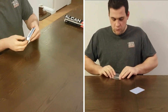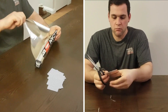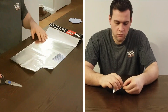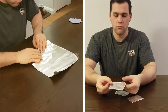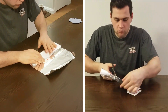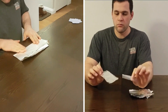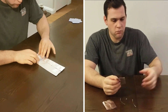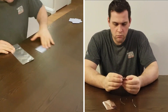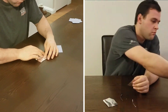While the cathodes are drying, I'm going to prepare my anodes. I'm going to take 10 of my playing cards and use one of them as my template, and I'm going to cut out 10 pieces of aluminum — again, slightly smaller than the playing card, with the exception of one piece which I'm going to make double the length of the playing card. This step is really critical because if the aluminum pieces are larger than the card, they could arc out to other cells and short circuit the battery — which, after spending all this time on, is definitely something you don't want to do.